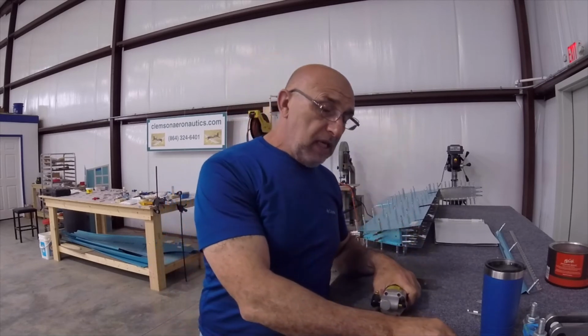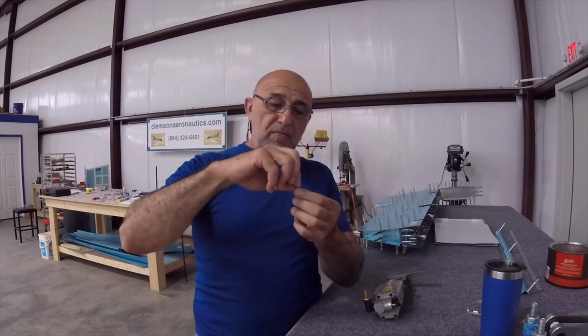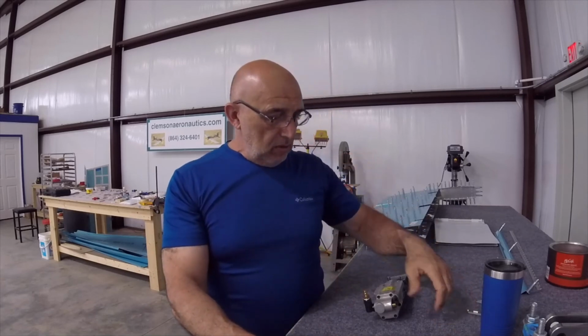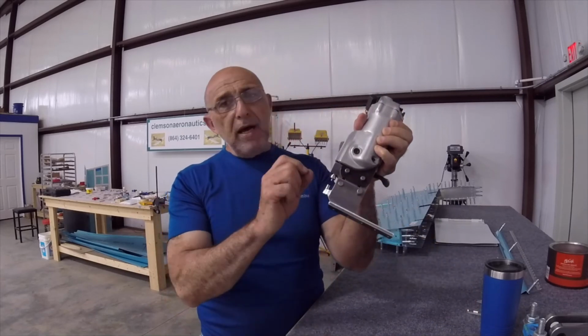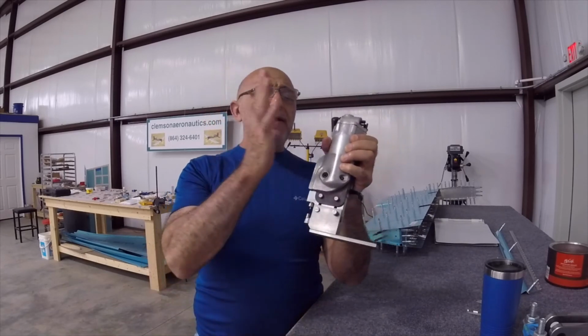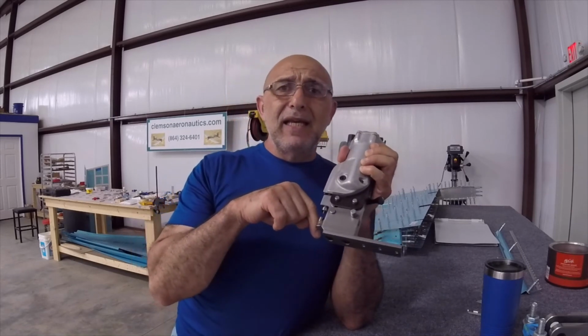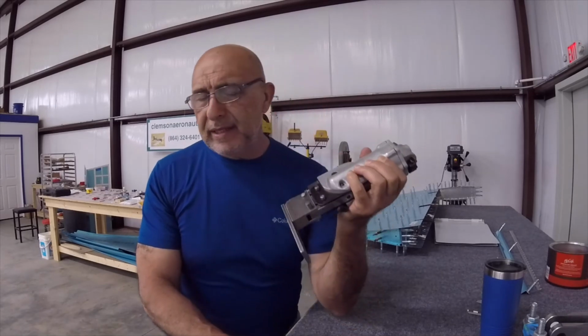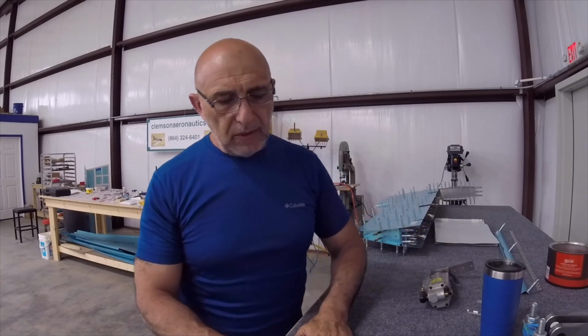Then when you put the material, that material is what's gonna give you the good punch in there. Now, you start and do one, and immediately take a rivet and put it in there. Make sure it's nice and flush, there is no gaps or anything like that. If it is, continue on and keep an eye on it. If it's not, another 1/8 of a turn and redo it again. So don't go too much on that, because you're going to be putting all 3,000 psi into this on your material. So you really don't want to expose the material to that kind of pressure. It's not meant to do that. So that's as far as our rib dimpling option is concerned.